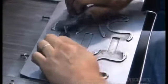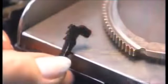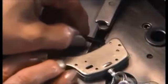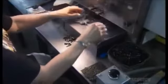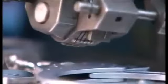These cuffs look complete, but they aren't quite ready for a life of crime. They need to be toughened up. So they spend 25 minutes in a furnace, and the searing heat hardens the steel. This is the pawl, a spring-loaded bar that will engage the teeth of the ratchet. They lock the pawl and spring in place. A press pushes pins into the assembly to hold everything in position. Then they stamp serial numbers onto each set of handcuffs so that the police can keep track of them.